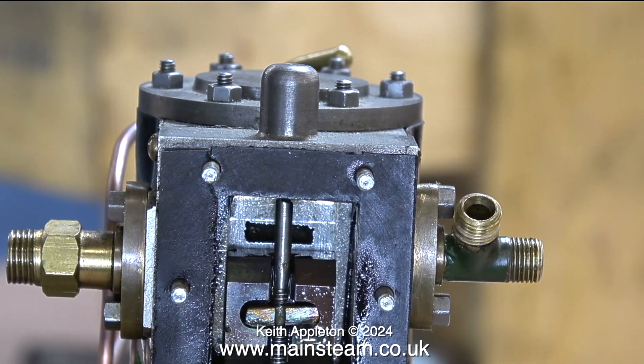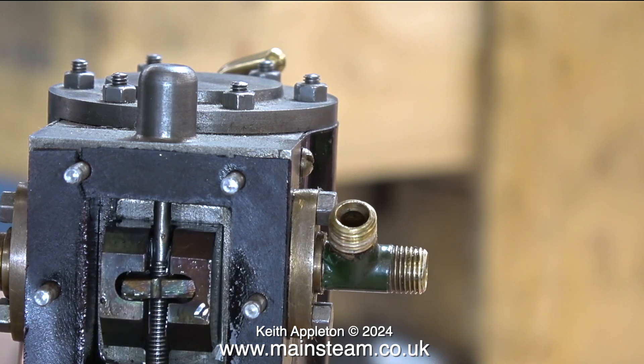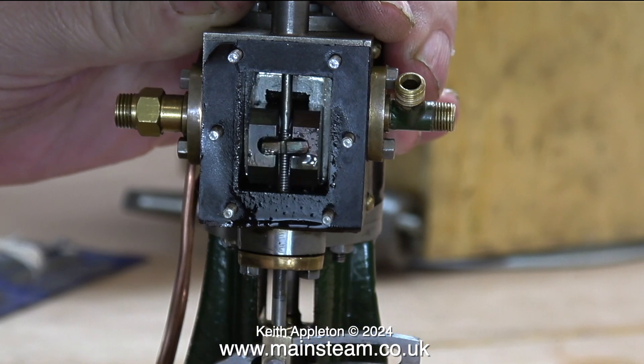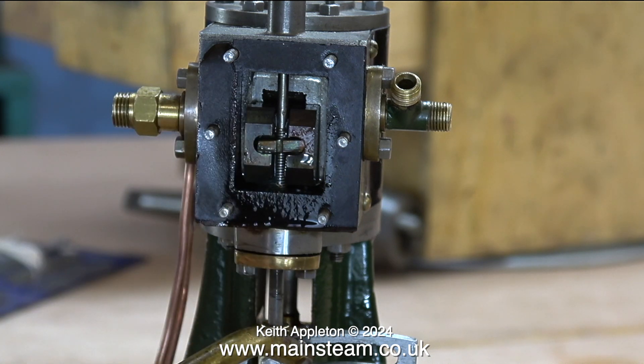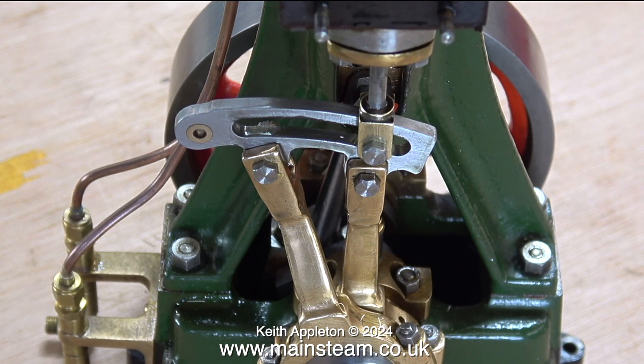Here's a close-up shot of the valve travel. The edges of the ports look a little bit ragged because of the casting, but that really doesn't matter. As you can see, the valve still needs some adjustment — it's uncovering the top port a little too much but not uncovering the bottom port enough. I need to remove the bolt, remove the die block, and rotate the valve rod anti-clockwise to allow the valve to be centralized over the ports. I'm also taking this opportunity to apply some oil to lubricate the moving parts of the reversing gear. It's essential that the expansion link slides very smoothly from side to side over the die block.